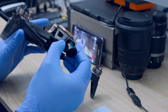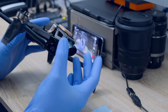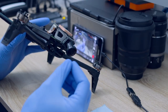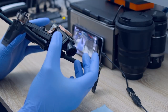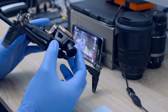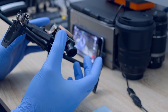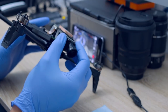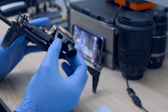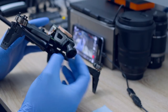I will start with the image noise. In theory, any image sensor, when it gets really hot — the hotter it gets — the more noise it creates, or the more little dots you see, or more artifacts being created within the video or the picture. I noticed this as well when I do photography and I'm pushing my ISOs, and also doing video and long recordings with the camera giving me overheat warnings. I noticed towards the end before the overheat, the image is very grainy or noisy.